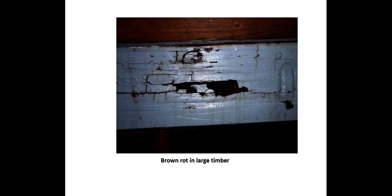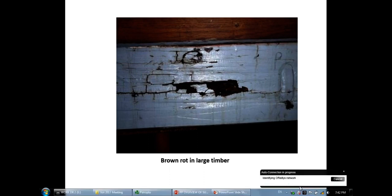This is an example of a heavy engine hatch timber having brown rot. Brown rot is caused by an organism that spreads rapidly from the substructure of the timber. The characteristics of brown rot are cubical or rectangular sections that easily collapse upon a manual pick test inspection. While the suspect timber may appear normal and the coating unaffected, the cellular fungus is working its way from the interior to the exterior, leaving in most cases a deceptive veneer of sound wood. Close visual inspection, pick tests, and tapping with a small mallet or cut-off broom handle that returns a hollow sound from the timber can indicate if the member is structurally compromised.